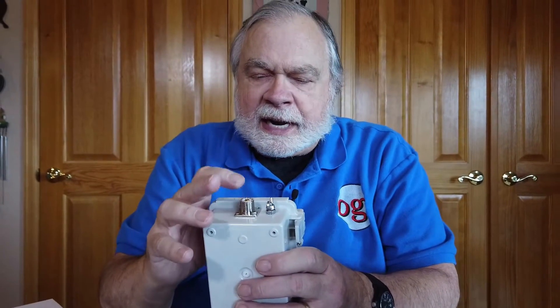You do want to get it up fairly high for the low bands. This piece of wire is a little too long for the 80 meter band, so it'll tune on 80, 40, 30, and 20 meters. It'll tune on all those bands with a wide range tuner. I would recommend connecting this to LMR-400 or something similar, with as short a cable run as possible down to your tuner. You'll need a wide range tuner, like one of the MFJ tuners, the 10-to-1 tuner. And if you go to different spots in the same band, you may have to retune.